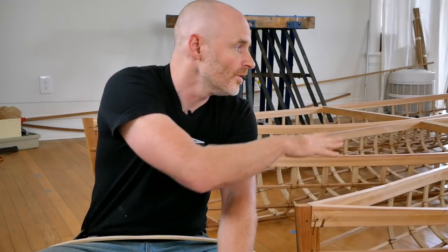I'm on day 11 of working on my new double paddle canoe design. So this time what I've done is laminated up a new set of gunnels at a little bit of a different shear and also a little bit of a different height to change the flex. And I brought them into the main room here, set them up, and I started putting ribs in to check to see if the rib system that I figured out the last time was going to be stable to work